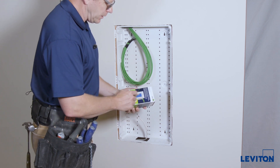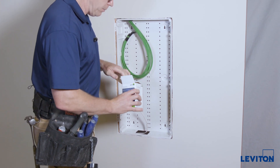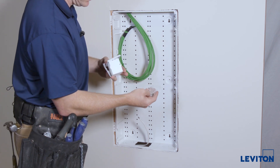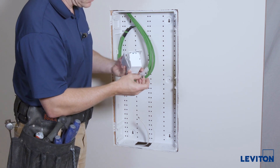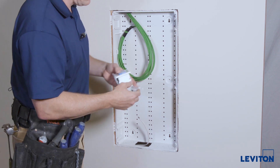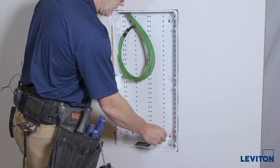We're going to be installing this kit — this is the 47605 ACS — that includes a surge-protected outlet. In the electrical box, everything you need is inside here to put power in this enclosure. The black screws secure the electrical box to the enclosure, the silver screws connect the outlet to the box, and there are trim screws to put the decor trim on. Don't lose those and don't let them fall into the wall cavity. The instruction sheet walks you through everything.